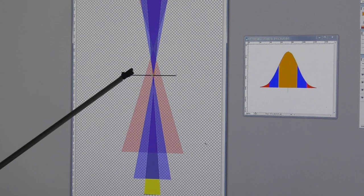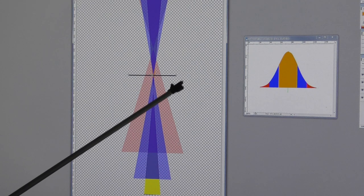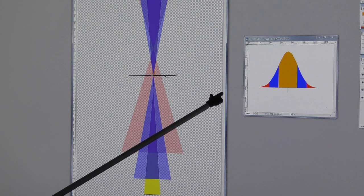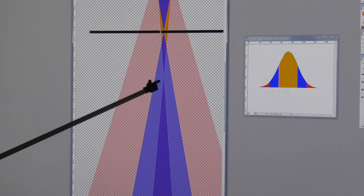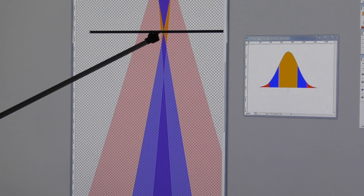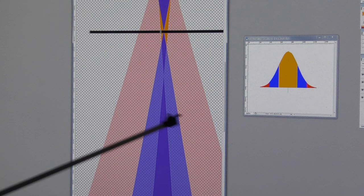If we raise or lower the lens, we're effectively changing the intensity group of focal points for that lens. Where I've got it set there at the moment looks to be maybe the best focus. But is it really? So although I've raised the focal point here to something that looks maybe better than the one that I showed you previously, in reality, this entry point here is now a much bigger diameter than it was when it was down here. So it means we're going to get a wider cut and a slower penetration.